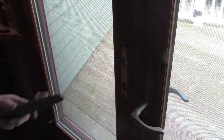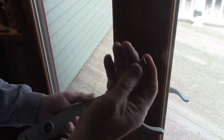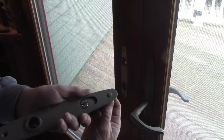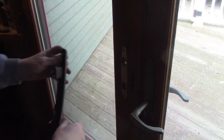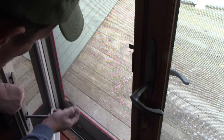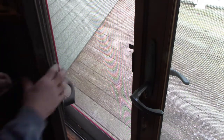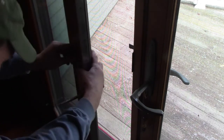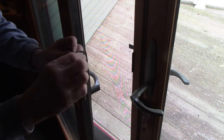So let's go put this in again. This is the outside piece with the lock — it's just held in there by this rubber gasket for now. This is the accepting piece and it does have little grooves in there, so they do have to be seated correctly. That goes on this side, then your handle comes through. We'll put a bolt on this side without the face plate just to cinch it in. Then we work on getting the rubber and lock mechanism — just this little tumbler deal — seated properly.